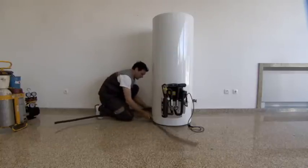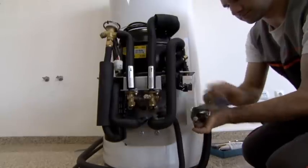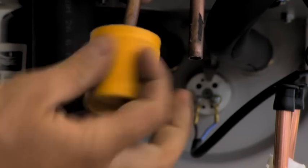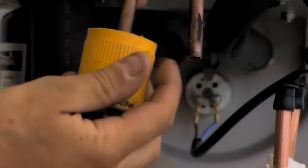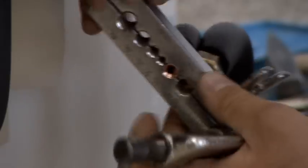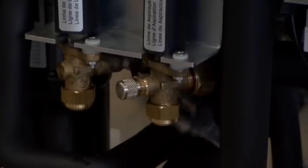The connection of the pipe to the block should be initiated by a correct measurement of the pipe's length. Use the pipe cutting tool to cut the tubes at the exact point of connection. With the reamer, remove all existing burrs without forgetting to put the lid back on. Repeat the steps to flare the ends of the pipes, placing nuts at the pipe side and removing the copper lids. Tighten the nuts, initially by hand and finally with a wrench. After all connections have been made, the panel and connecting pipes should be subjected to a pressure test to ensure there are no leaks in the circuit.